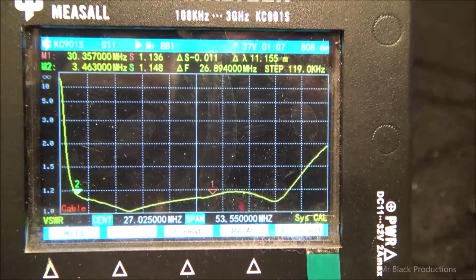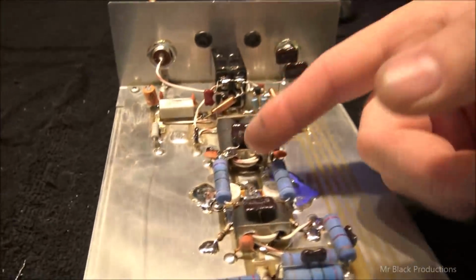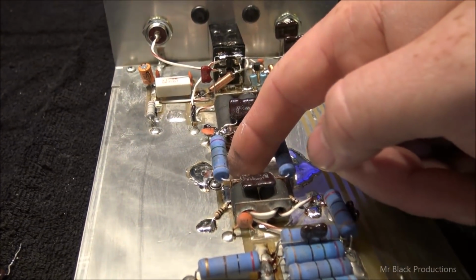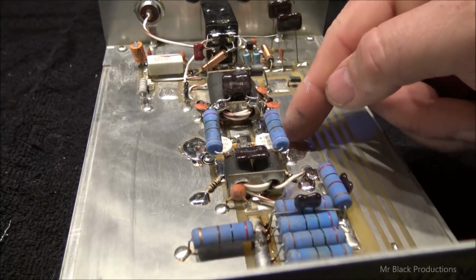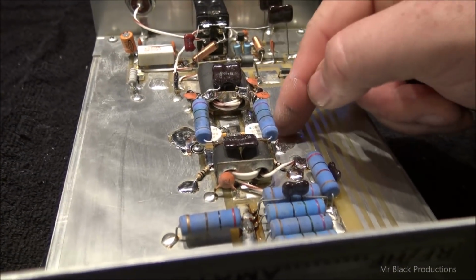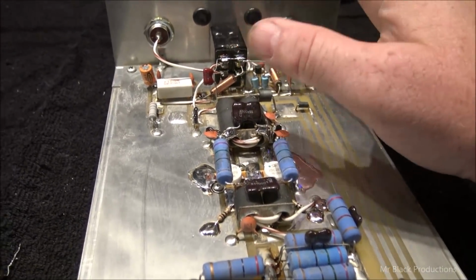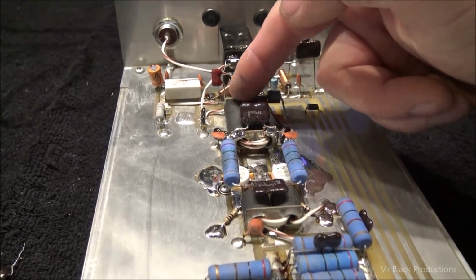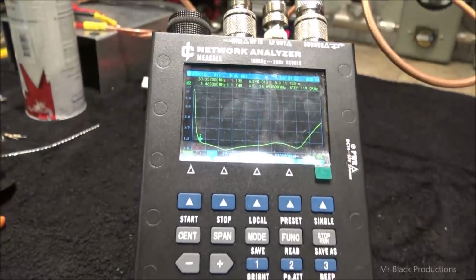This allows me to do circuitry emulation, so I could set this device up so that I can feed, let's say, this side of the transistor without the transistor in place, shunt load this side of the circuitry to ground to emulate a transistor with couplings of capacitance and resistance to ground, and then load this with a little bit of RF, hook up my coax connector to the outgoing coax connector and close this relay, and then look at the whole circuit all the way out to here and be able to make all the different adjustments I want with this particular unit.